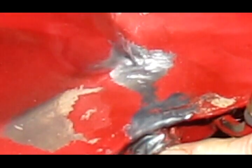You can see they solder some of their stuff too. We'll sit and let that dry for a minute. A lot of you are going to ask: do I have to wait till the tank's completely dry inside? The answer is no — we're not getting it that hot and there's no open flame. I'm using a Weller soldering iron, and first I'm going to put a little bit of flux on this joint to help the solder flow. If you don't put flux on it, it's not going to work good.